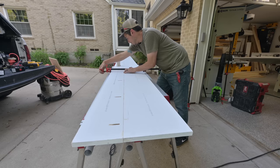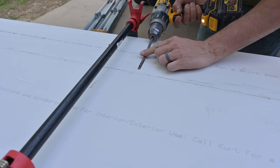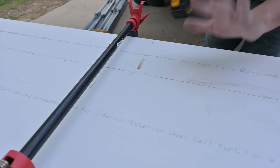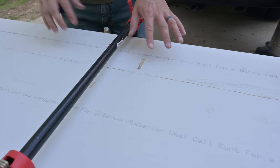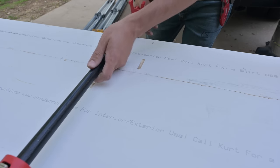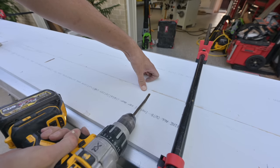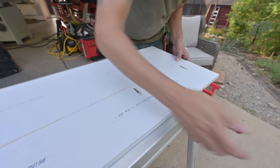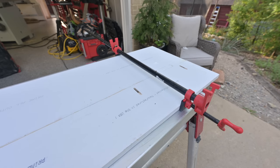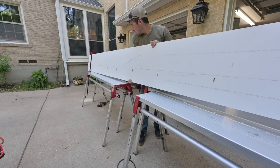I'm using this just for alignment — if I'm smooth, then I'm going to send it. I'm flush right here. I used to drive my pocket screws with an impact and realized that was a bad idea. Now I just drill them until they're pretty snug, then I back off. I don't want to make that joint weak — remember, the glue is going to do most of the holding here. The pocket screw is essentially my clamp. Then I take the actual clamp off and move up to align the next one.